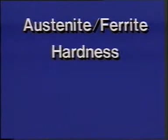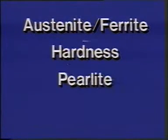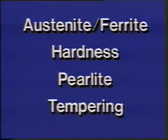Steel attains a solid solution phase called austenite at approximately 1700 degrees Fahrenheit. At room temperature, steel exists in a phase called ferrite. To increase hardness, steel is heated into the austenitic range and then quenched rapidly to form martensite. Pearlite consists of a layer of ferrite and a layer of cementite; when polished and etched, this material gives off an iridescence resembling mother of pearl. Once steel has been quenched it is very brittle. To recapture ductility, the steel is then tempered by reheating; as tempering temperature increases, room temperature hardness decreases.